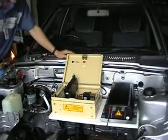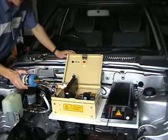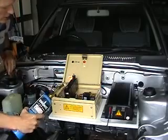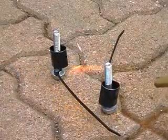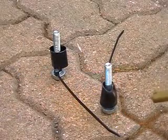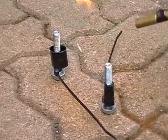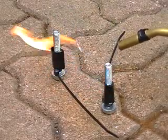Thanks for some very good advice I got on YouTube. I am now insulating the posts on the circuit breaker just with some very good heat shrink. I am now heat shrinking the base of the bolts that will be holding in the shunt, using cable ties to stop the heat shrink from sliding down too far, keeping some metal showing at the base of the bolt.